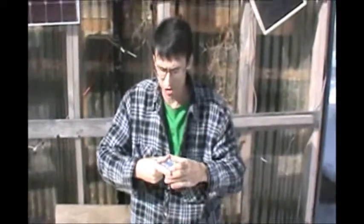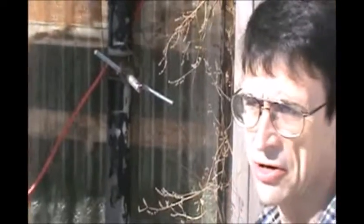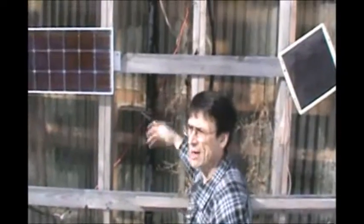Let's go around here. You see that muffler clamp right there? I've got another muffler clamp because I'm hitting large joists. So I've got another muffler clamp here — I'm hitting big joists inside, where the muffler clamp grabs the outer pipe. After you put everything together, it's catching that on both sides. The bite is unbelievable — they are biting right into that outer pipe. Then I just put extenders on what's left of the muffler clamp, and then I just go ready rod after that. You can get ready rod 20-something feet long, so you could have a bolt that's 20-something feet long if you wanted. I'm just catching through the joists as I go up, and that's how I got this side of the wall to 24-feet height.